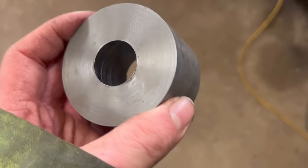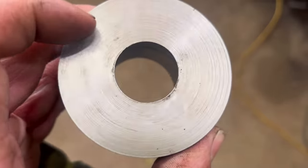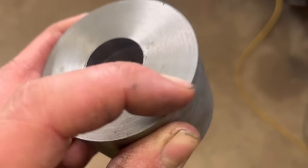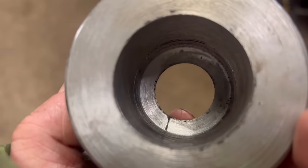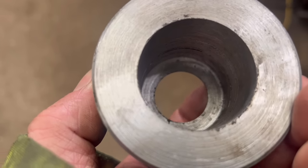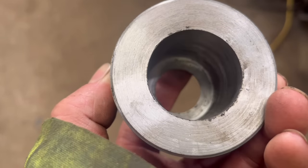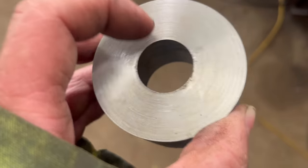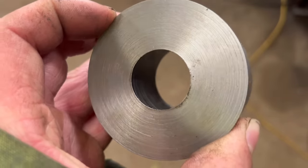I've got them cut off, just that one, because I hadn't drilled through it deep enough to start with, and then cut down the back of it, just left a bit in at the other end that hasn't drilled through, so I'll just take that with a die grinder. It's getting run through with the reamer anyway, so it won't matter. I'll just remove most of it.